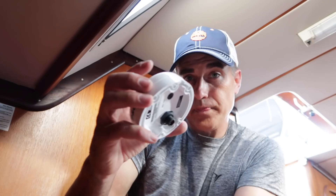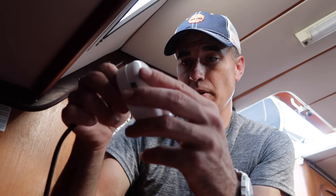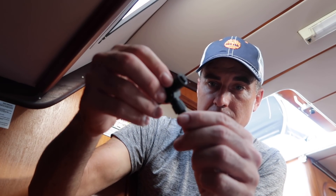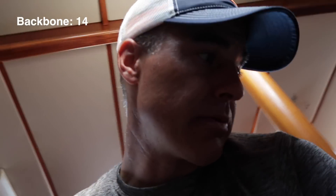Here's our GPS device. Just to see if the system works, I'm going to install the GPS at our midway point. It has the same kind of connector on the back. It has its own T-connector - I'm going to connect this to the component piece of the T, and then connect our backbone through here. I've now got another length of backbone cable that I bought at the store, and I'm going to run this section toward the batteries where we're going to use the next connector as our power supply. Then we'll have another cable of backbone that goes to the screens.